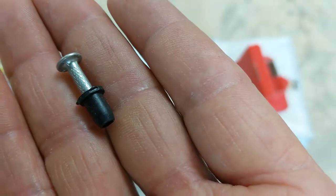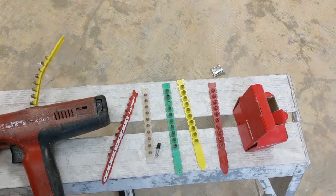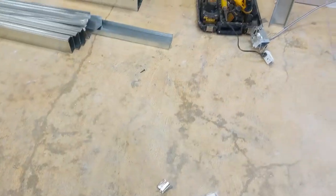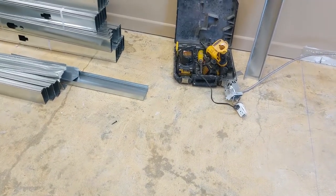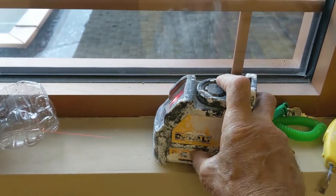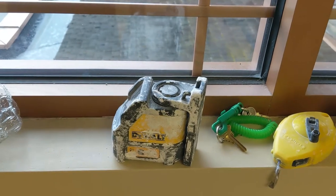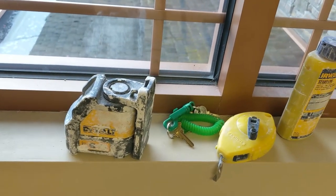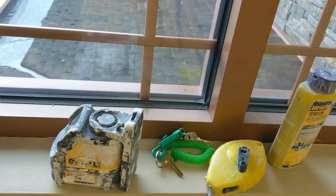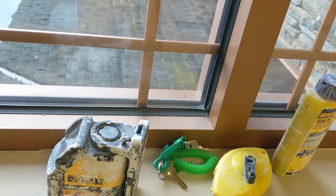I have another video doing that. And the tools that we use — beside that, to screw the steel stud, we just use a regular drywall screw gun, nothing special. And then a chalk line to snap the line. That's very much about it — nothing too crazy, very easy to work with. A tiny snipper to cut the metal — that's it, not much tools are required.